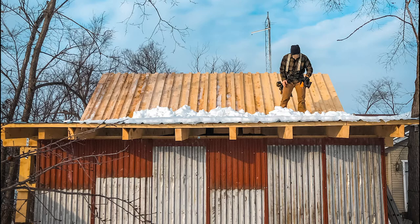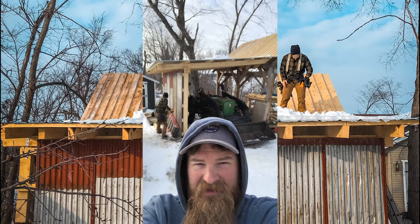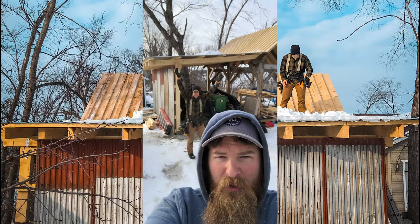Happy Sunday friends, big news! Kevin just finished screwing down the battens — the last few boards and the battens for the roof. That means the south side is done! We still need to finish battens on the north side. We kind of learned our lesson that we should have done those as we went along — now we've got to clean snow off the north side and go back up and put those in place. Then we'll do a little ridge cap, and somewhere in all of that we'll frame up so we can start doing siding.